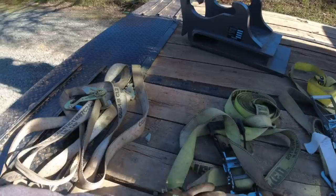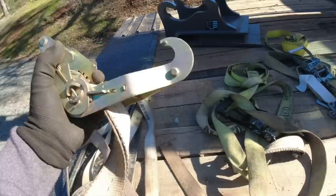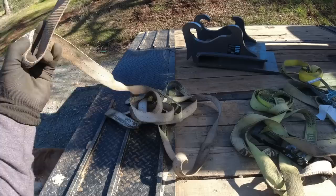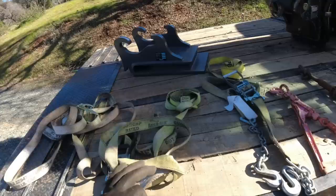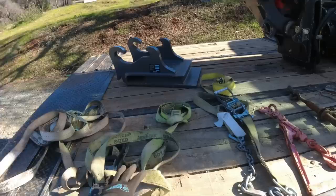I got them all laid out - all the ones I own. So I got these - they look kind of chintzy but they're actually quite a bit tougher fiber than this one here. This one's rated 5,000 pounds. These ones are kind of neat because they slip down into there and work perfect. Slip it back out - you gotta modify them to make that happen. The other side is a simple little hook you can get in your stake pocket. I really kind of like these. On a flatbed trailer they work great, especially on a rub rail and stake pockets. Again, they're rated 5,000 pounds. You get these ones that are like a Home Depot kind of addition - around 3,500 maybe 4,000 pound rating on those things. What I like using these for because they're quick, simple, easy - tying down the booms and stuff. To be legal, if it's a turret machine or articulating machine you gotta have something to stop it from going side to side, and something like that is simple enough and will get the job done. But people kind of frown upon that depending on the location.